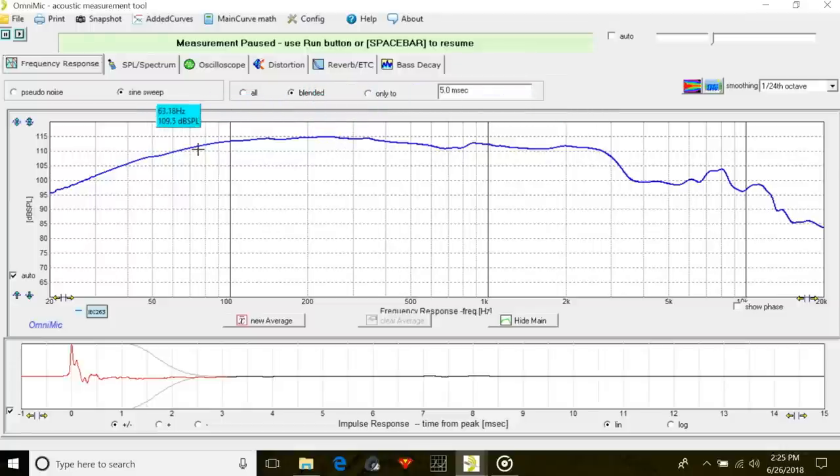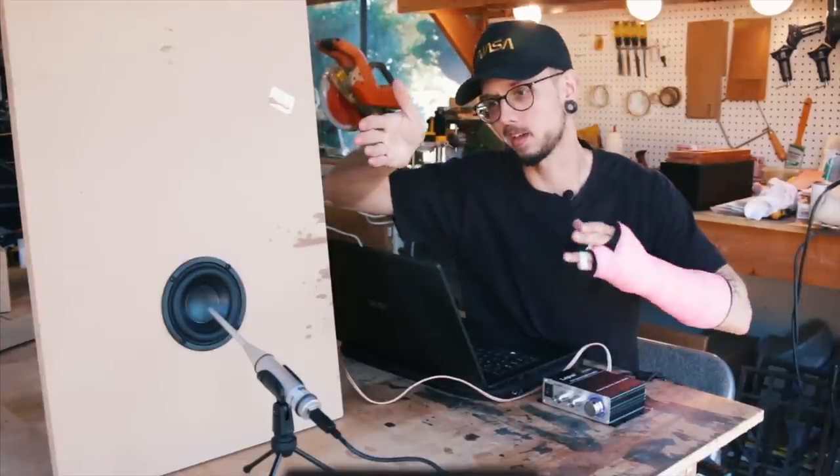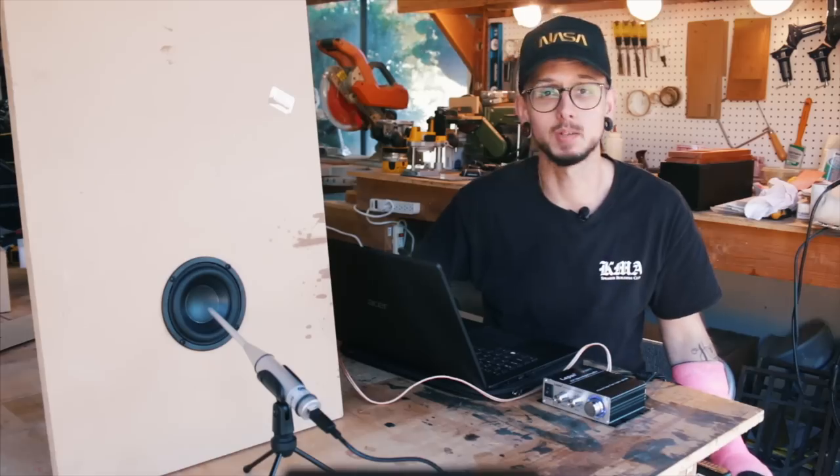From 60 hertz all the way up to almost 3,000 hertz, we're within 5 dB of each other, and a lot of this is about 4 dB. We got a little dip here and then a big bump up here that we know about. That's pretty good. It's a nice mid-woofer with a little bit of extension — with the right enclosure we can probably get down to 50 hertz within negative 3 dB. That looked pretty good, and that was at one inch.